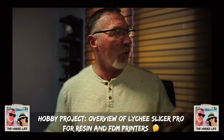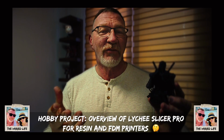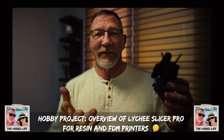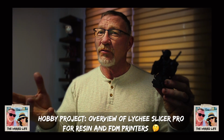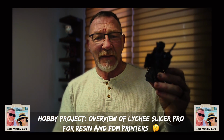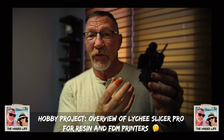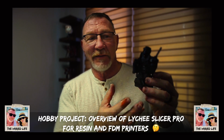And yes, you absolutely need a slicing program. Because basically what happens when you have an item that you want to print, it's in a digital file, an STL file normally for resin printing. And then what that slicing program does is take the model and it slices it per layer. And in this case, it's 50 micron is the layer height. And so it'll slice that. And so it goes onto the build plate and goes into a vat of resin, UV light activated resin, and then the light shines up through the bottom through a screen and an FEP or a film that allows the light to hit the resin, and once the liquid resin is exposed to those specific layers that have been made by the slicing program, that hardens, and then of course everything's upside down.